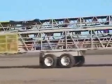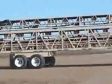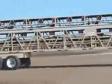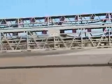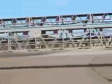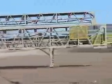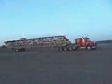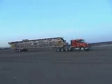The Overland Telescoping Conveyor comes complete with 3-ply conveyor belting. A rubber blade spring-loaded belt scraper is located on the head end. The dual motors each come standard with 150 feet of 6x4 power cord. The design incorporates safety features that meet MSHA standards. The conveyor is designed so setup can be completed quickly and easily.